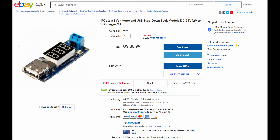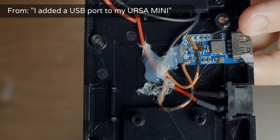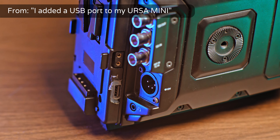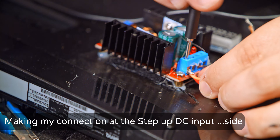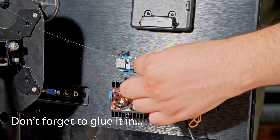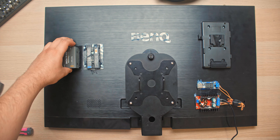From here, I added a second DC converter already set to step down to 5 volts, which conveniently has a USB port as an output. You can use the same small board that fits under the V-mount plate, but I'll be sticking to this larger one since it has a voltmeter that helps me know how much battery I have left. We connect this in parallel to the battery plate and it's ready to go. This can be used to power an SDI-to-HDMI converter — there are 4K versions, but since I'm using a 1080p monitor this is plenty. We simply attach it to the back with some Velcro.